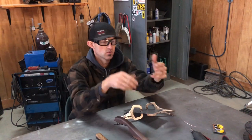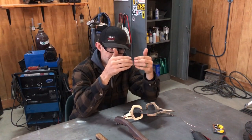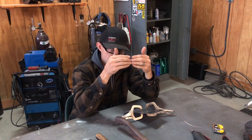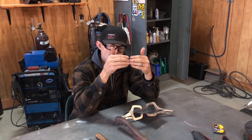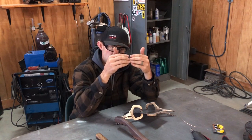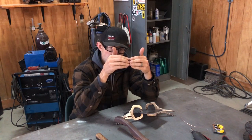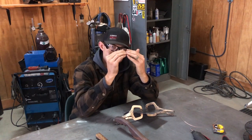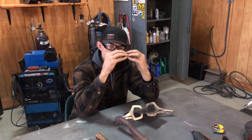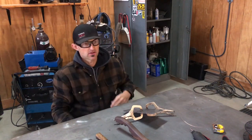And the reason why is if this is the panel, right, and there's an air gap where my index fingers are and my pinkies are. So this welded fine, it pulled, it's gonna pull just a little bit. But what happens is when you start welding these two together, now it's moving the panel this way. Well then, when it moves that way, your gap on the other side, now when you go to weld it and fill that air gap, now it's gonna pull again. And that metal is gonna keep doing this. So what happens is it's gonna start puckering. And it'll pucker your sheet metal and you'll be like, man, what is it?